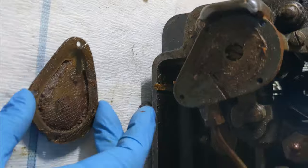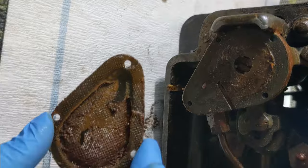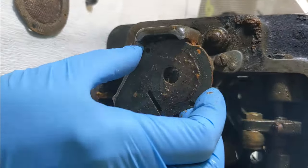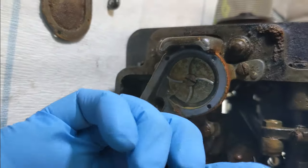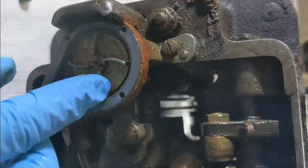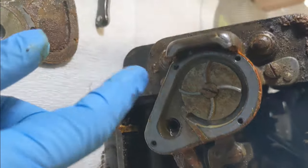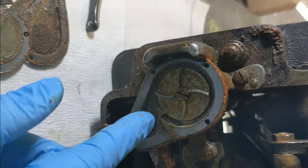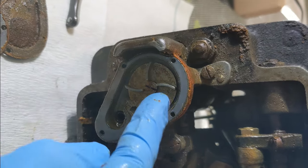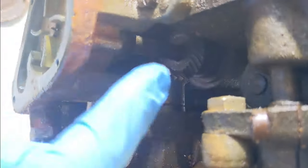As soon as I got the last screw off, this whole thing popped off — very nasty, incredibly nasty. This looks like the cap to it. And there is my impeller. As the motor turns and the belt is turning and the gears are turning, this spins also — it's linked to the gears inside here. So when the machine is running fast, the impeller is going to shoot oil in here, which is going to shoot it up this pipe, which is going to push it wherever the pipe leads in the rest of the machine.